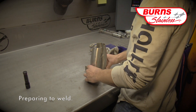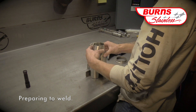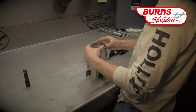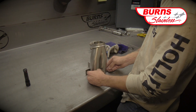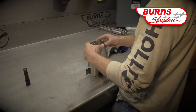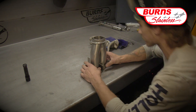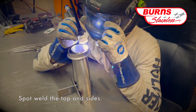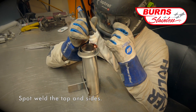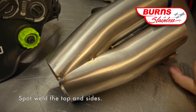The welders will take the two tubes and fit them together. He actually uses a shim to keep the bottom of the collector separated, and then takes a piece of tubing — in this case he's using a flange — in order to close the gap on the collector and get it tacked up. It's usually best to get the top tacked up first and then place a few tacks down each side of the collector.